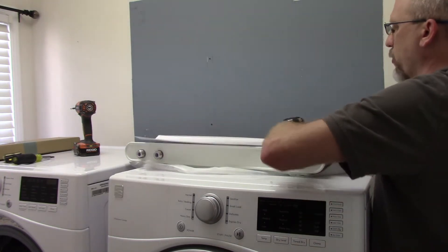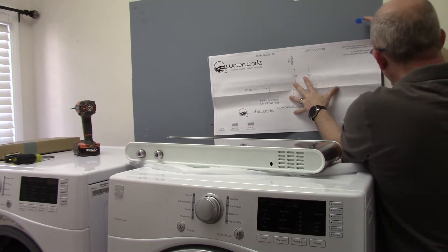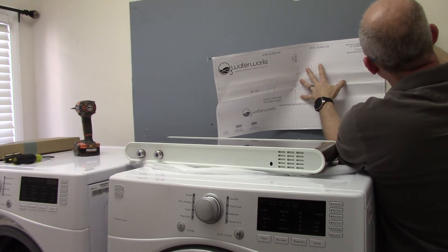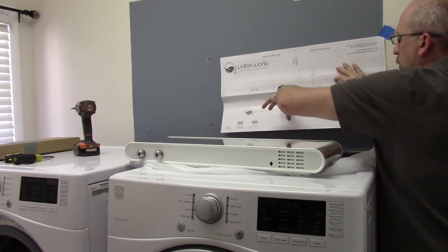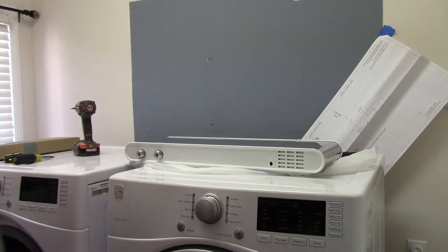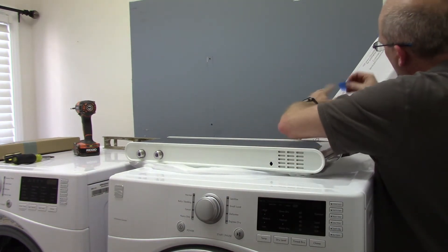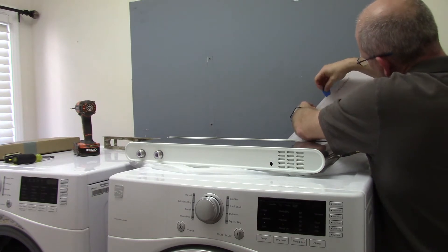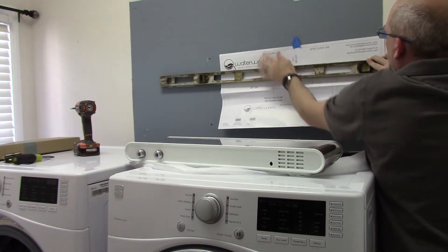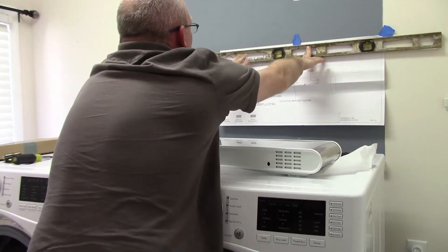What I've always found advantageous when you're going to hang up something like this and need to level it is you find the edge that you're wanting to reference. I put a little nail mark in there of where I want to reference this, and I only put a little bit of tape right at the corner, a little bit loosely. Why? Because I want it to be able to swing when I put the level on it. We put a little piece of tape right here and then take the level to it — and we're level.